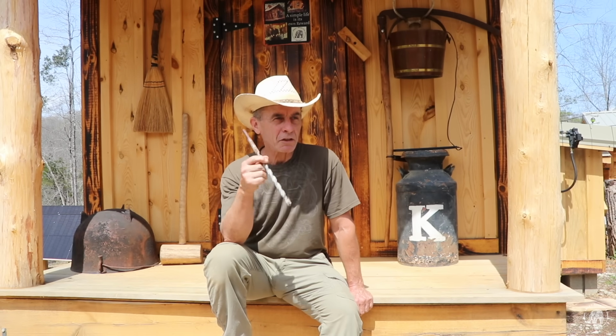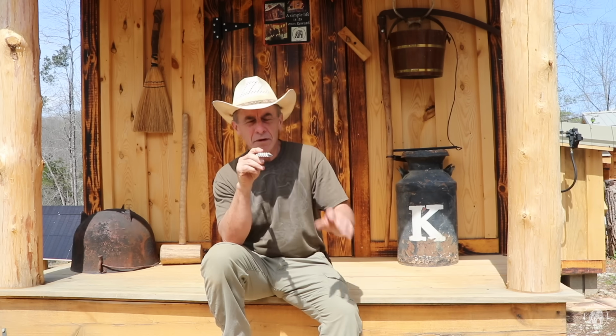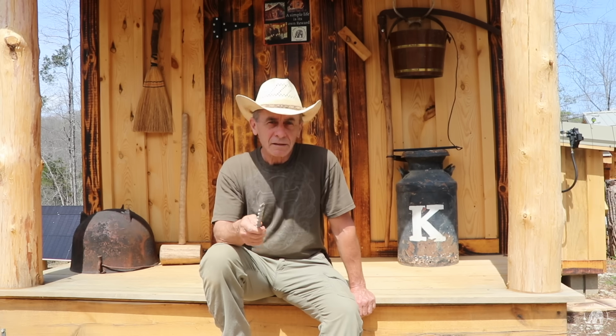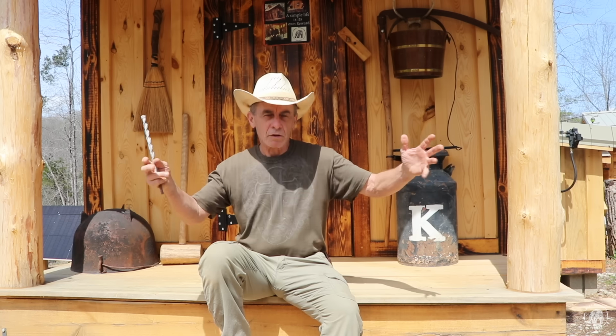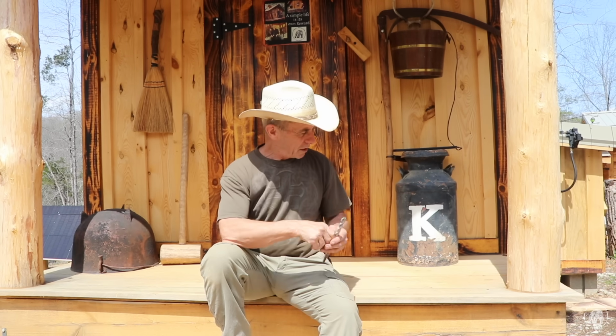I think what we're going to have to do is drill a bunch of little holes in there, maybe about 1 inch apart, and then try to bust it out with a sledgehammer, because I've tried to rent a pneumatic jackhammer. I just don't have one other than one of those great big ones which we can't hold on the side of the wall. So it's going to have to be a hammer drill and a concrete bit and a sledgehammer, I believe. But I think that we can get the job done.